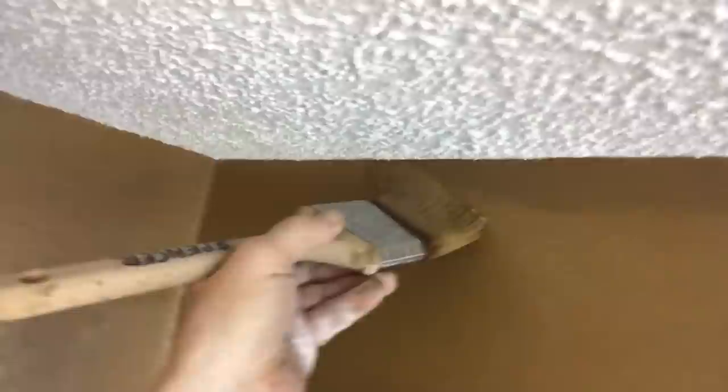My paint is nice and dry here. Get it up in that corner — it's so nice. Those of you who paint know what I'm talking about: you can see the brush just push that paint and glide. If it doesn't glide, you won't do a great job. This is why you want an angled brush — look at how it gets into this corner. I can push it in there, stop at the ceiling, pull down, and go right up again. My brush is a three-inch angle sash brush.